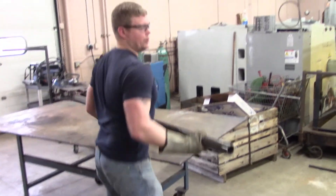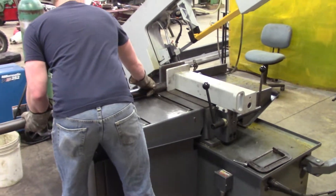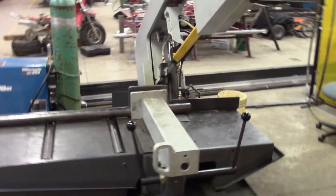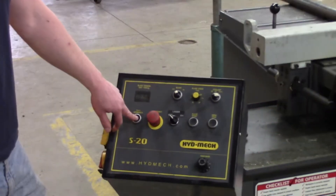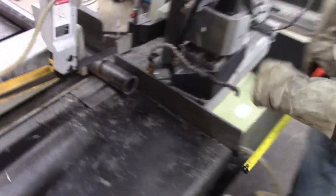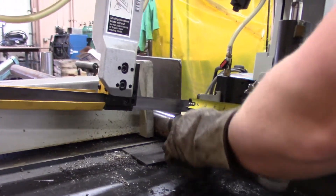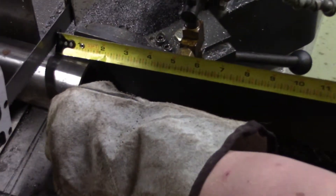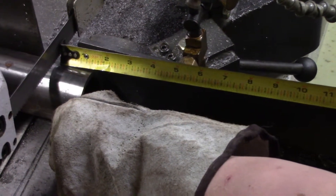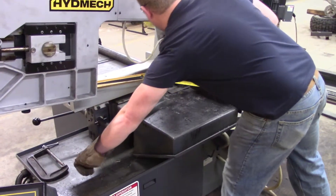Take it and bring it over here. When you want to take your measurement, you're going to hit fast across to get it down close enough for an accurate measurement. You want to get this just above the blade — you don't want the blade actually touching the metal, otherwise it's going to rip the teeth off. Move this over to an inch and a half. Then you push this clamp down and that clamps it into place.